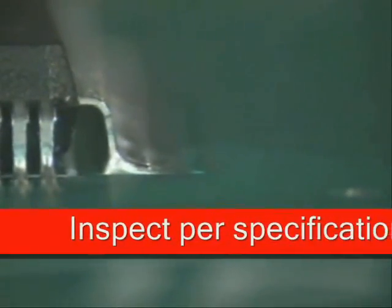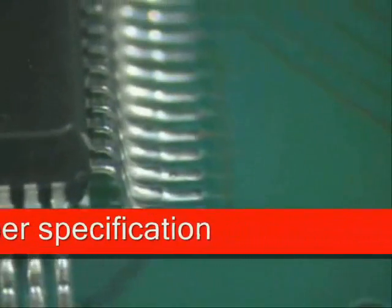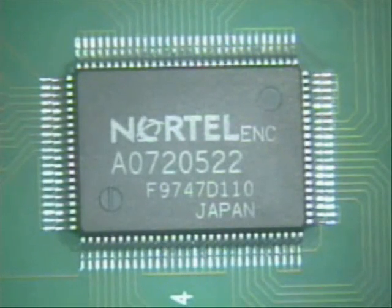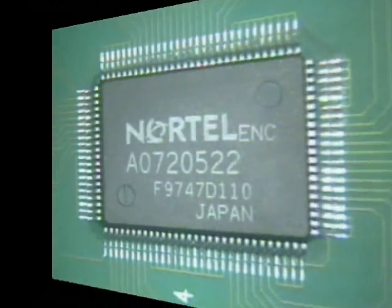I'm going to come down here to that side — it's at least one. Look at our solder fillets. If you notice, it's not shiny; it's kind of dull in appearance. Remember, our standards say that some solders are dull, matte and grainy in appearance, and that is fully acceptable. This has been Norman Muir with Best Incorporated. I hope you've enjoyed the soldering of a QFP100 point to point.